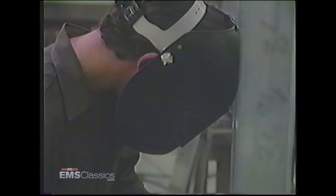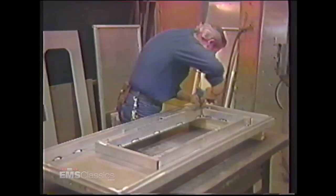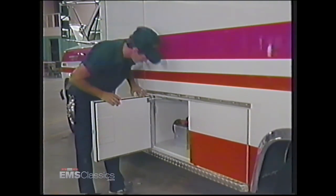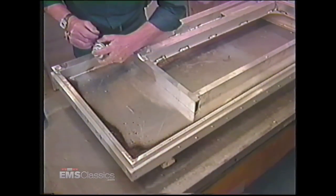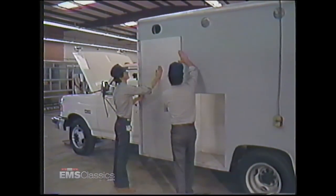In another part of the plant, door construction is by now underway. We weld tubular aluminum structural members into specially extruded door frames for strength and support. Our 2-inch thick doors are specially designed with double surface sealing to prevent water and dust seepage. We mount the door seal on the door instead of the jamb to prevent seal damage when equipment is moved in or out of the compartment. We spray the inside of doors with a rubberized undercoating for insulation, protection against oxidation, and soundproofing. We then hang and fit the doors to precise dimensions for lasting service.